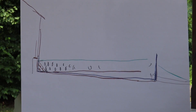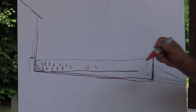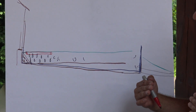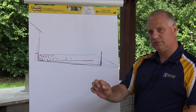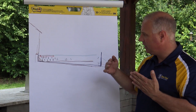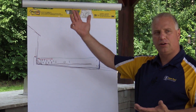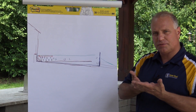After the base stone is down, put in your screed rails — one-inch screed rails, two of them — and screed out number eight or number nine stone. That's your three-eighths chip stone, very angular, locking together. Screed that three-eighths stone across the whole surface. Put pitch on it if you can — you want water to get off the surface eventually. Even permeable systems require maintenance; pollen and debris blow into joints and eventually clog the pores a little.